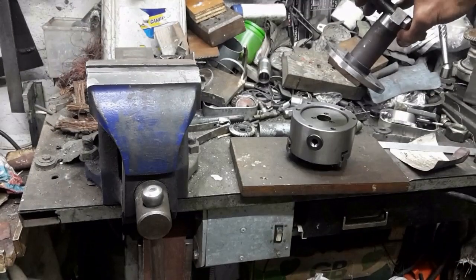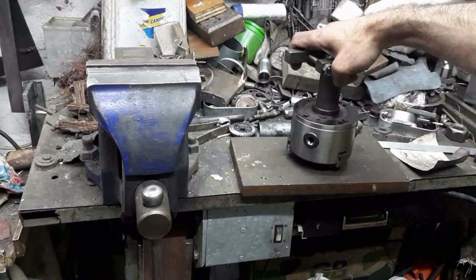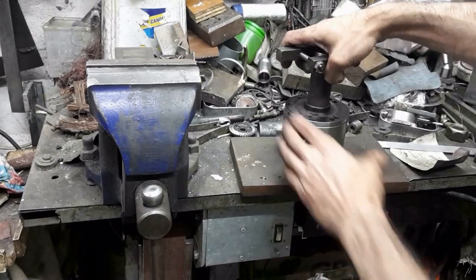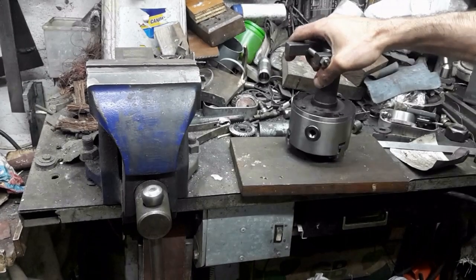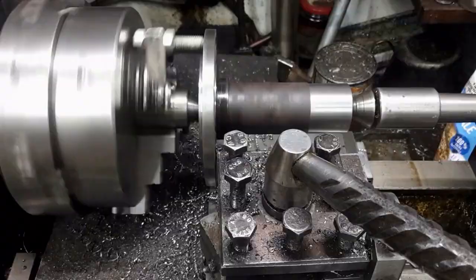At the start of the taper, I aim for a squeak under the chuck back inner diameter. The chuck is not fully seated, yet still holds on the taper. The only disadvantage is that the chuck must be jacked to unseat it from the backplate.